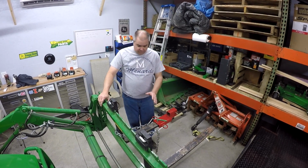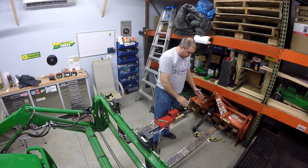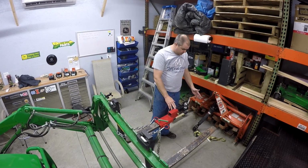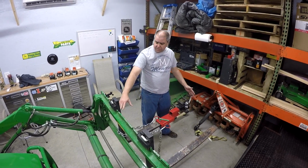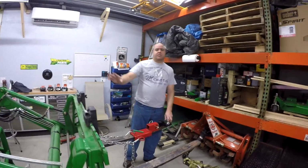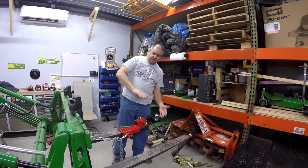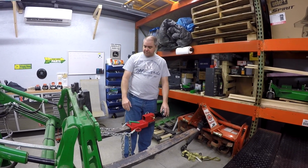If you recollect, where we were is we had this hitch all the way out here. It was 45 inches, another 9 inches further out to this side, okay? And with that much length, it just puts a lot of stress on the fork. And that was the thumbnail that we used, one fork being really deflected a long way, bent a long way.